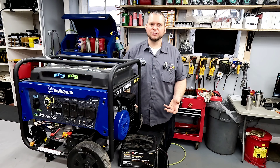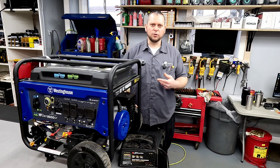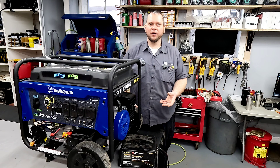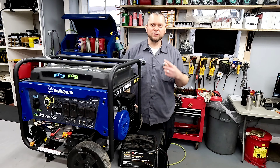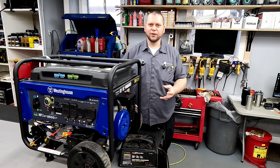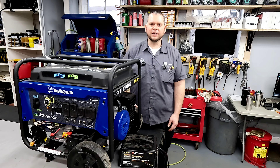That's just such a super easy fix. On these, you've got to remember that when they don't get a lot of use, that battery is just going to go dead from sitting. You only use it once or twice a year — make sure to charge up that battery. A lot of these do not have a stator that charges the battery as it's running. So just starting it and running it for 30 minutes once a month to keep the carb clean does not mean that battery is going to be serviced at the same time. It's going to need a separate charge, or you can put it on a maintainer — this one has a quick connect for that. Those start buttons seem to pull quite a bit of high amperage through them and seem to burn out pretty quickly. Bad grounds and voltage fluctuations can also cause it.